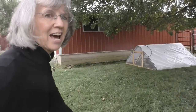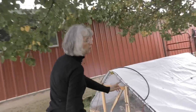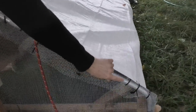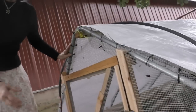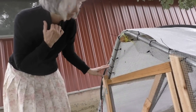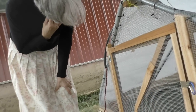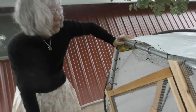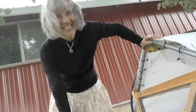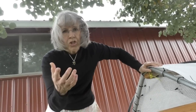A viewer asked to see the inside of the chicken tractor. This is made with three-quarter inch EMT. Jim made a jig — I have a regular pipe bender and that's what I bent it with, though I'm not really good at it. A jig would be better if you're doing many of these, although the pipe bender was a bit pricey so maybe a jig is the way to go to get the shape you want. The second one we're making — let's show the inside quickly.